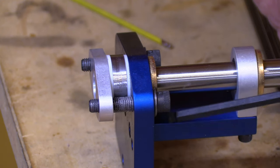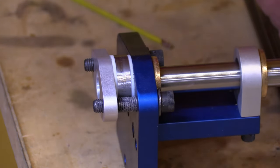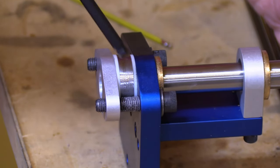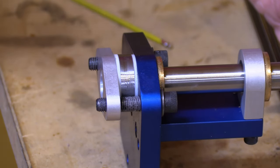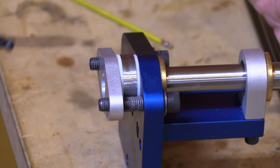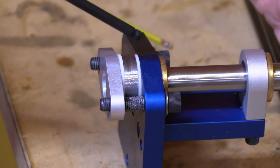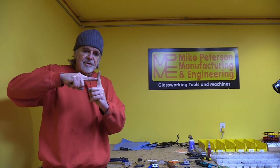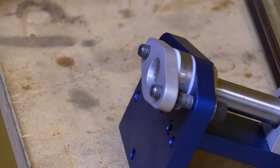When you take the adjusting tool — this little ball driver — you have a nice range of adjustment as you're tightening these fine pitch screws and compressing the Belleville washers. Because there's no force acting to unscrew these screws, they shouldn't come loose during use. I've seen a lot of products that do it the cheap and dirty way — just a brass screw touching the shaft — and I wanted to do something a little bit nicer than that.